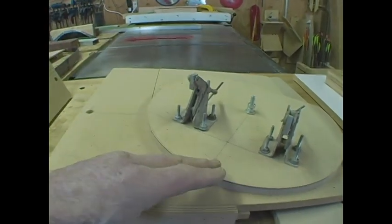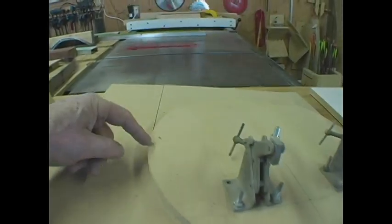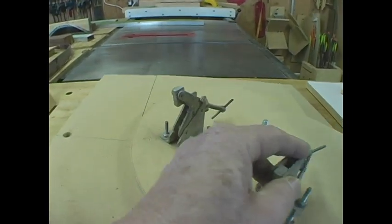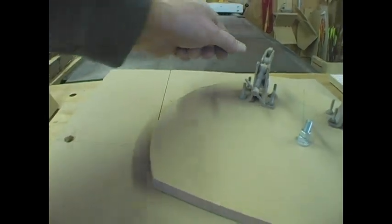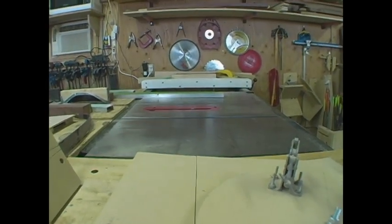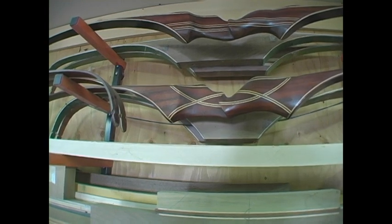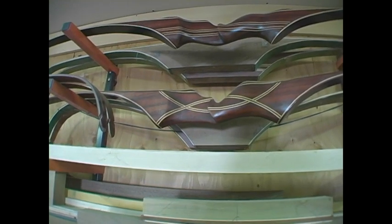For further contour cuts into handles, this bit here is a circle jig. The piece of wood clamps down in here, then it's brought to the bandsaw blade and we slowly bring it around to cut a half-circle out of the riser. In this case I did two cuts, and that riser has eight-inch radius circles cut into it — it's kind of a Celtic look to it. I'm not through with it yet; I've got some inlay work to do, but that's what that jig does.